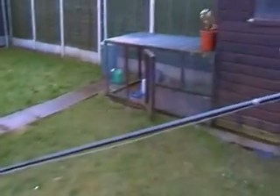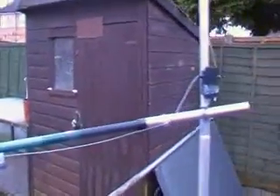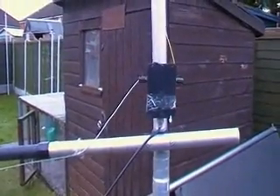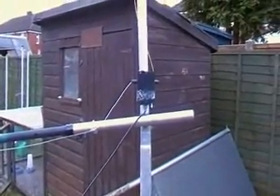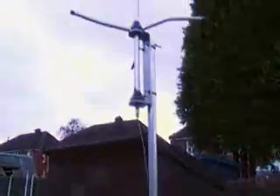Now this can be on the floor — the aerial can be on the floor and the radials can be on the floor — and it probably works better with 4 radials: 4 eleven-foot radials out in a star shape, a cross shape. But at the moment I'm just using one and I've had good results.